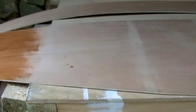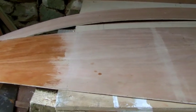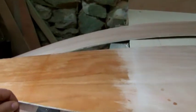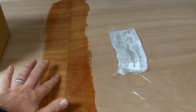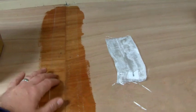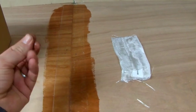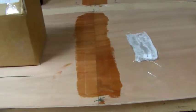If you're doing this on the floor, don't apply resin too far because when you turn the panel over you'll have gunk stuck to it if it hasn't cured. As soon as you start painting resin over wide areas it takes a bit longer to cure. I did this coat about 10 to 15 minutes ago and it's nearly touch dry — as soon as it is completely touch dry, I'll turn it over.